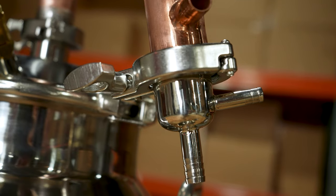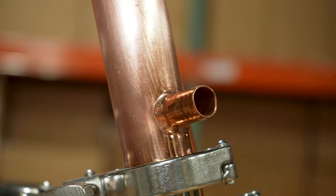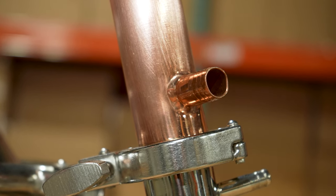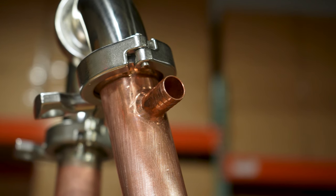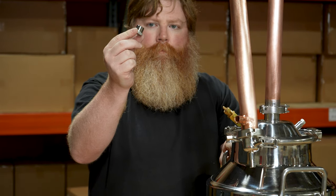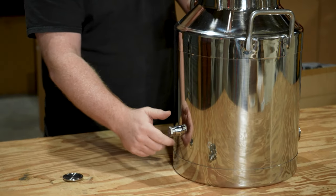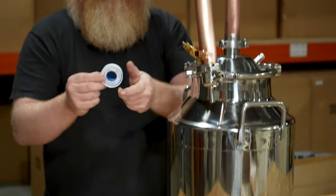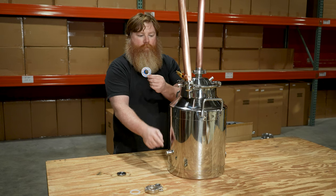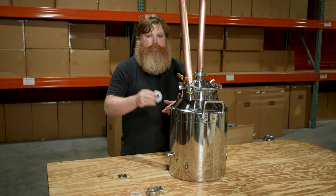Here is what the cup looks like when it's installed — the vent is on the right, the drain is on the bottom. Here is the cooling water input and the cooling water five-eighths inch output. Next we're going to be installing a plug in the half inch port in the boiler. This is another accessory port and regardless of what is installed here you'll need to add thread tape. Also double check to make sure you've added thread tape to both of the ports in the domed lid.